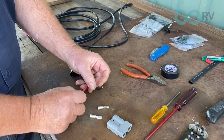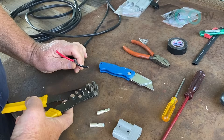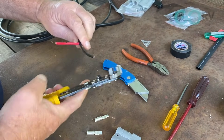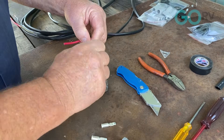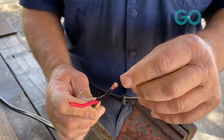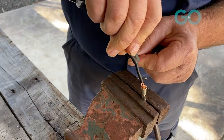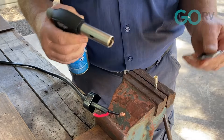The first method we're going to use is the soldering technique. To do that I'll terminate the wire. When it comes to terminating a wire I could use a knife or some side cutters, but I'm fortunate enough to have some wire strippers. I'll put that where it needs to be, pull that off, and that wire is ready to go. With the wire now terminated, I've folded it over itself just to make it a little bit wider so that when I slide it in it's a firm fit.